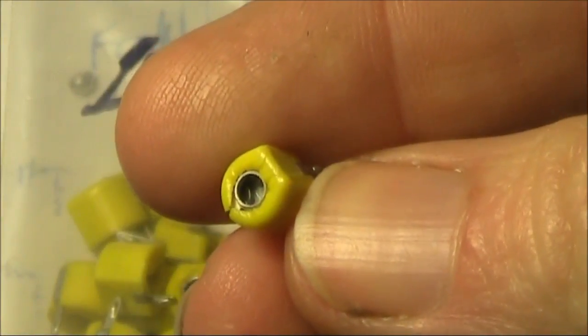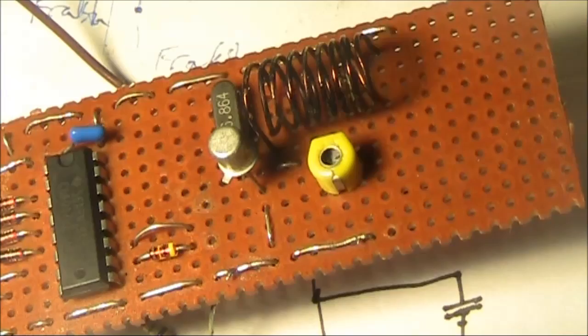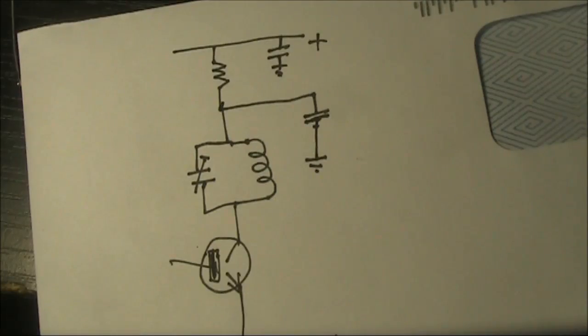A little trick if you're putting together a radio circuit using a trimmer capacitor. For those unfamiliar with trimmer capacitors, they are a type of variable capacitor whose value you'd typically only change occasionally. Applications in a circuit include as part of a bandpass filter, a matching network in a radio frequency amplifier, or a tank circuit in a free-running radio frequency oscillator.